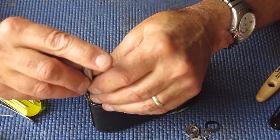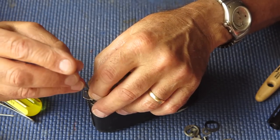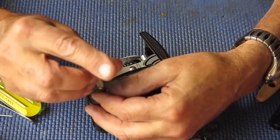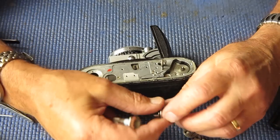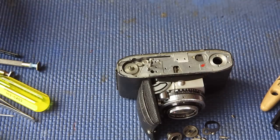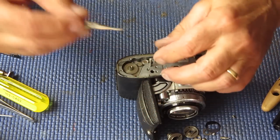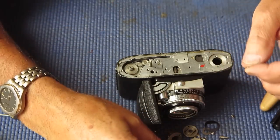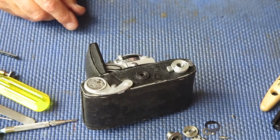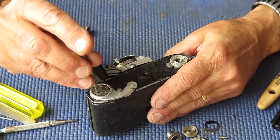Right, so far so good. See what we can find. I'll remove the strap lug at this end of the camera. The rewind assembly complete. I'll take the screw and spring from the top of this lock lever, the shaft and the lock lever. I'll remove the circlip and spring from the top of the end of the film lock. And now I'll start work stripping the base of the camera. Three screws on the advance lever — they're loose.